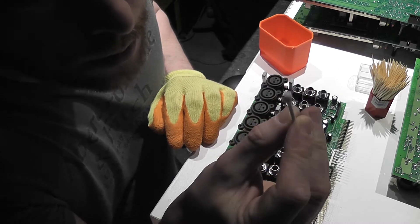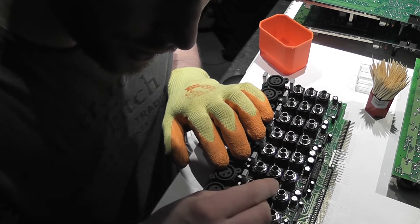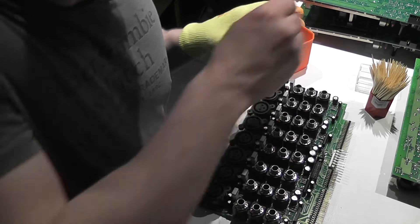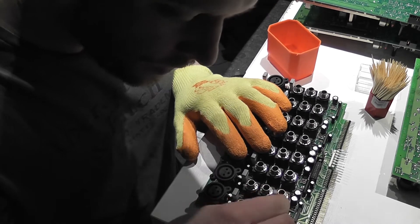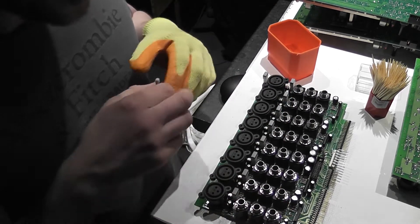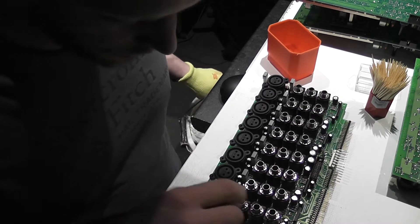It's not too bad but it still comes out a little bit dirty. I sort of use one end of a bud per two or three jacks — maybe just two on this occasion. It just gets any stuff out. Bear in mind that I've already gone over this with the dust spray and brushed it off, so this is just to clean out these sockets.